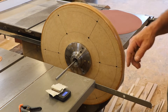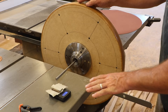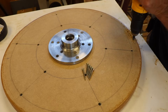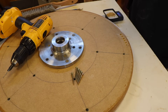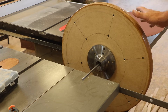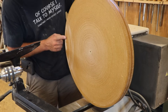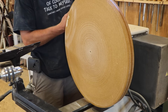So that's 14.9 grams but it's all the way out on the periphery. I'm going to be putting screws in a little bit, so I'll need probably a touch more weight to counter because it doesn't have the same lever arm. These six screws weigh 15 grams. The sawdust weighed 0.9 grams - so a little bit. Even though those screws were not long enough to get all the way through, they still bubbled the surface up slightly, so I just hit it with some sandpaper and put a little CA glue on it to seal that surface again.